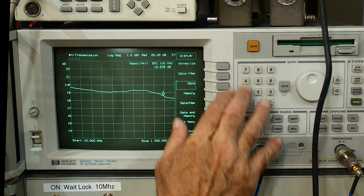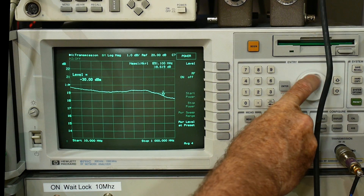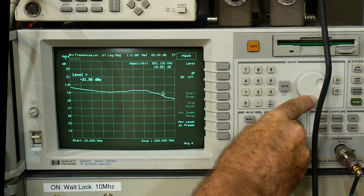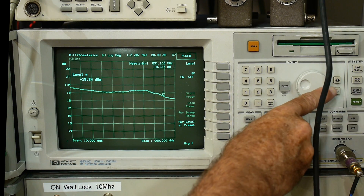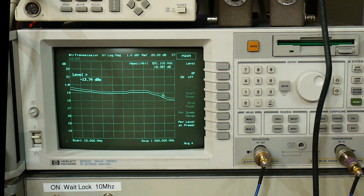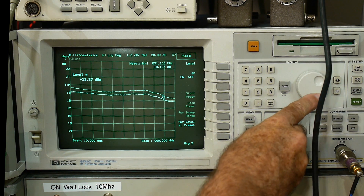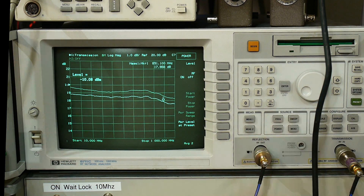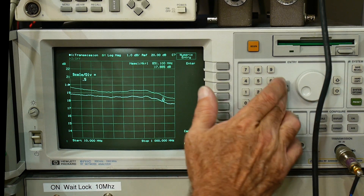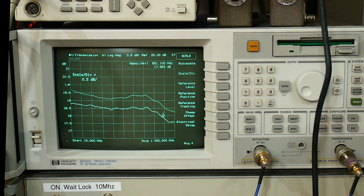What we're going to do is remember this trace while we do the other measurements, and then we're going to up the power. We're going to go up to minus 22, minus 21 — still measuring exactly the same. Let's go a little bit higher. Wait a minute — here at minus 13 dBm input, we're not getting the same gain. It's lowering, and that is the compression — we're compressing. When these two curves are 1 dB apart, that's around here. We can scale in to 0.5 dB per division — you can see that these are 1 dB apart, and that's where the 1 dB compression is occurring, at minus 10 dBm.